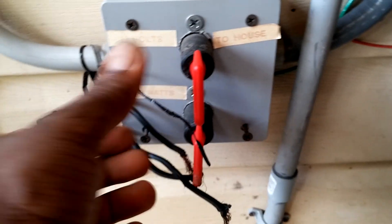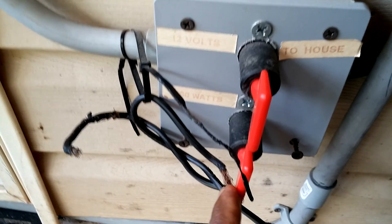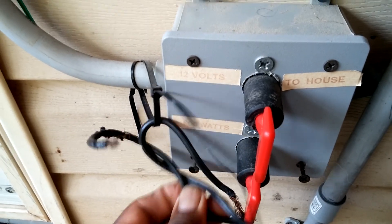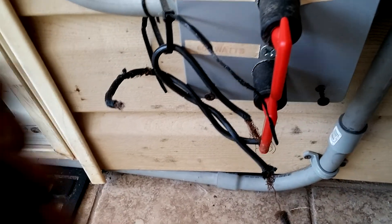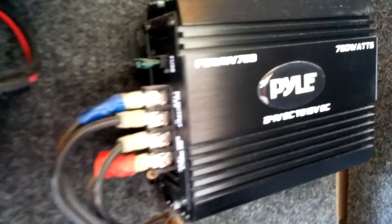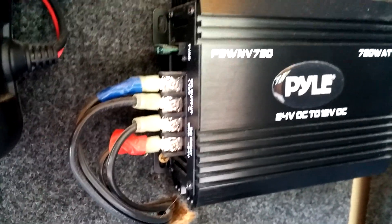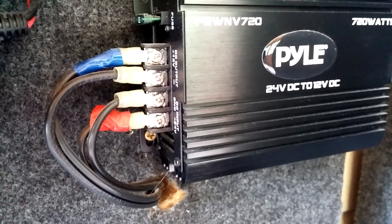On another set of array we have 960 watts that we could turn off. This is my first set of panels on the roof — 600 watts. I have this piece of wire here because my dogs keep chewing on it, to prevent everyone from turning it off. They are growing up now so I could take this off. This is the 12-volt output going to the house, which goes upstairs to the bedrooms because we have low-voltage lighting up there. In my bathroom I have an entertainment system built off a car stereo, a 17-inch monitor and surround sound speaker system.